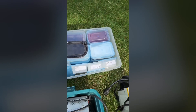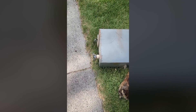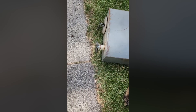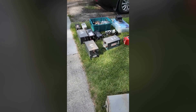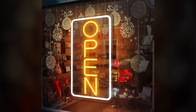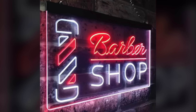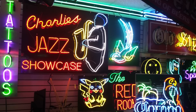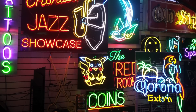Before you get discouraged and think that these experiments can only be done with tons of expensive lab equipment, let me state for the record that all of these experiments were done prior to receiving any equipment from C.J. When his equipment arrived, it was just icing on a long ago made cake. The only serious piece of equipment you even need is simply a neon sign transformer — a high voltage, low amperage device, about 10 kilovolts AC and around 0.06 to 0.08 amps. These are now antiquated and likely gathering dust in a dark corner of your local sign or billboard shop. All I had to do was ask. They were free.